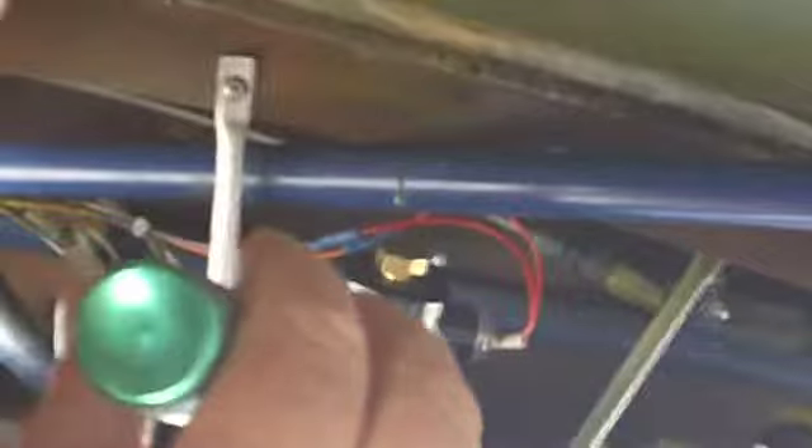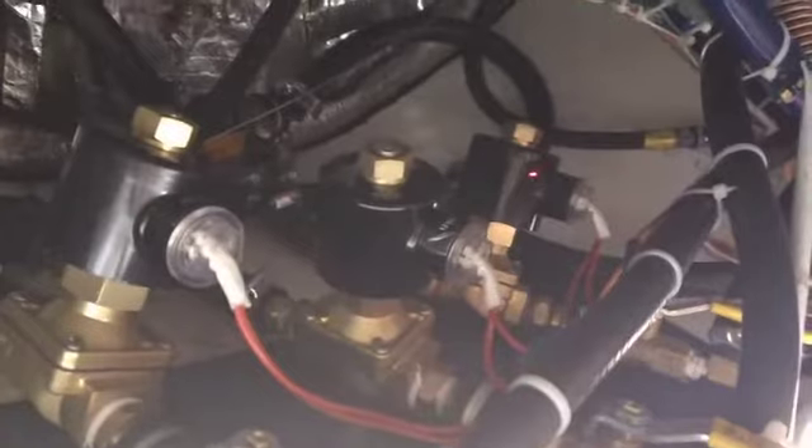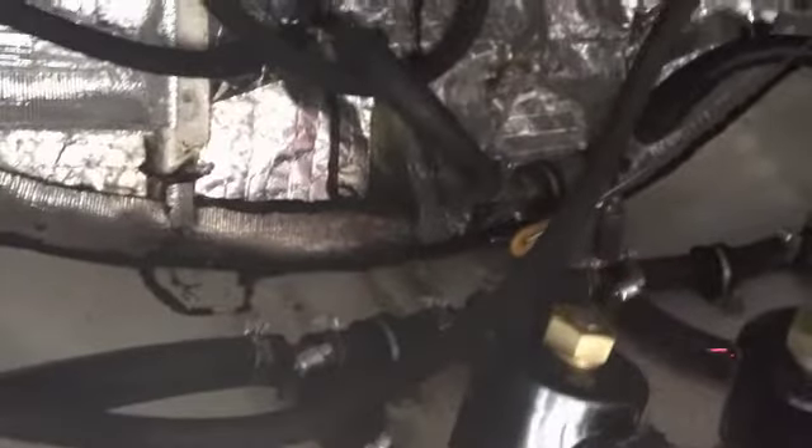You can see the infrared pointer. This is the electrically-fired solenoid, and there's one just like it on the other side of the wing behind Rebecca. The original fuel line routing is followed all the way to the belly, and this is a maintenance valve right here. Being a mechanic, I wanted a way to isolate all these valves to work on them in case they need to be changed. We've zip-tied them open, but we have one on each line so that we can isolate the entire system. This is the main tank solenoid, the fuselage tank, and this is the left upper wing and the right upper wing. Same exact pattern — maintenance valves ahead of each so we can isolate them — and this is the manifold we've created to handle the fuel from all of these solenoids.